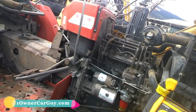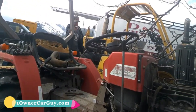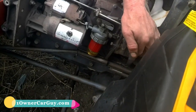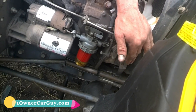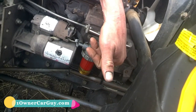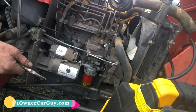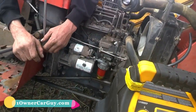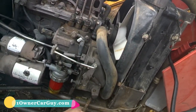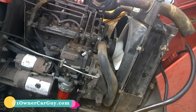I don't think it's going to start anyways. Well, you think the stop cable's been pulled? I pushed the linkage forward manually. It's all the way up against the stop, isn't it? Right here? That one. Okay, cool. You know where the linkage is. That's my question. It should be all the way. If I pull, that's pulling this bottom in, so it should be out. Should all be out. Yeah, it should be. So pull the top in, see if we see that here. Twist it like that if you need to. You want me to do what? Push the bottom out of this one. Just double check. Because all it would do is shut off fuel. It should still fire on the ether, though. You know what I'm saying? That's what I don't get. Yeah, it was in. It was right.